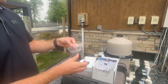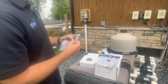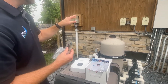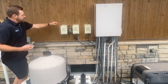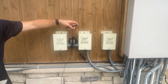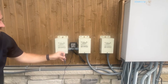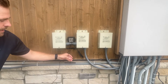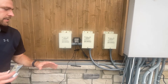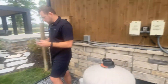We'll get the sensor out of the box and take our epoxy with us. Now, this is actually very important — as we're going to start the pairing side of things, we want to make sure our antenna tip is 8 to 12 inches away from any metal. Since it was tucked in close to metal, we're going to let it drop for now just for pairing purposes. We want to make sure it's in a good spot before we stick it to the wall. Come with me, we're going to go to the pool.